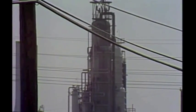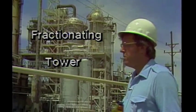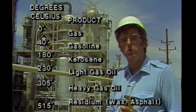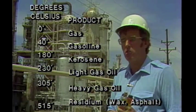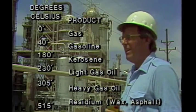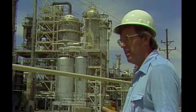There's a modern refinery in the background, and many of the processes going on there are very similar to those which occur naturally at that asphalt seep. This is the very heart of the refinery — the fractionating tower. In very simple terms, crude oil is put into the fractionating tower, and heat boils out different components or cuts at different temperatures. The shorter the hydrocarbon chain, the lower the temperature at which it boils off. For example, natural gas (carbon 1 through carbon 4) is a gas under normal room temperatures. Different size molecules boil off at different temperatures at different areas of that fractionating tower.